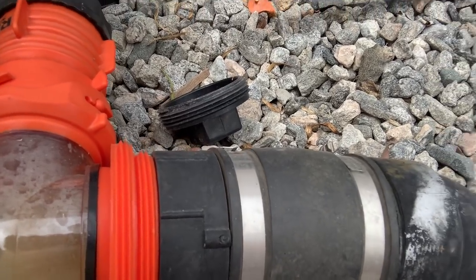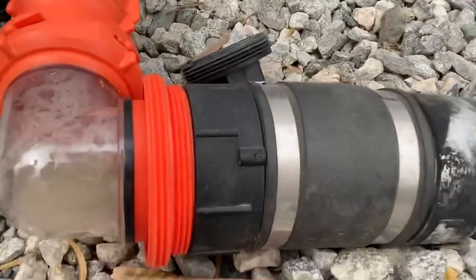It's a little dirty right now, and after about five minutes of doing that it'll actually wash it clean - nice and clean water coming out. I usually like to do it about 10 to 15 minutes, depending on how long it's been sitting there - maybe 20 minutes. You can already tell it's starting to get a little cleaner looking. You really want that to be crystal clear coming out; it fully washes the whole system.